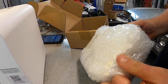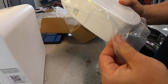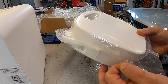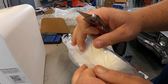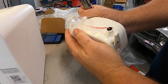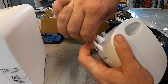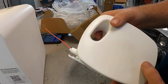Now we get the new filament out. Note — not only is it wrapped in bubble wrap, it's actually in a vacuum-sealed package. For a lot of your 3D printing materials this is very important; they do not like excess moisture or heat. That plastic can actually absorb moisture from the air, so if you're not using the filament you need to put it back into something like a ziplock bag, or you can get actual vacuum-sealed bags — I'll leave a link to Amazon down below.